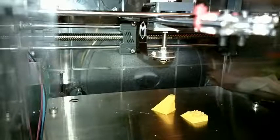So what I've done is I've sanded down those edges a little bit. So now they're angled in at about 45 degrees, which should mean that it doesn't catch anymore, and certainly this time the filament did not catch when I fed it in. It just went in nice and smoothly. But because of that, I have to start all the testing again because that may affect the data.